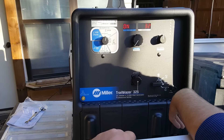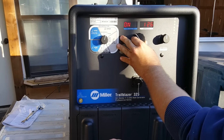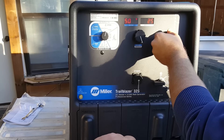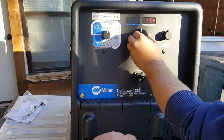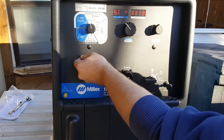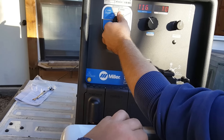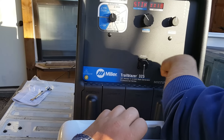Oh, that's full blast. 32 amps. How many amps do you want to burn that rod? About 125? No big deal — there you go, 125. You want to go 325? No big deal, there you go. There's your stiff — stiff limit, zero at the start. That's pretty nice. Burn that rod at about 125 — yeah, some 7018 at 125. Normally burn 7018 around 120 and burn 6010 around 90 on the other machines we've been using at work, but this one I'll have to figure out. Yeah, every machine burns a little different.